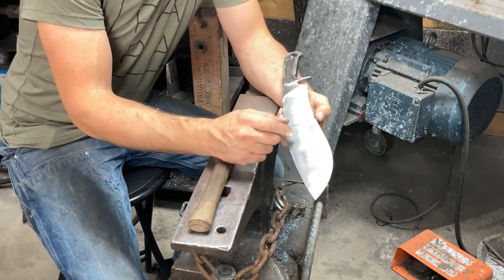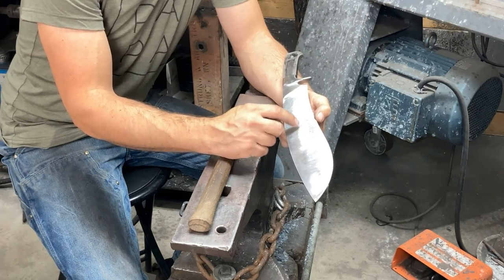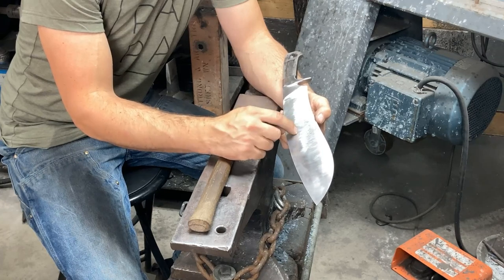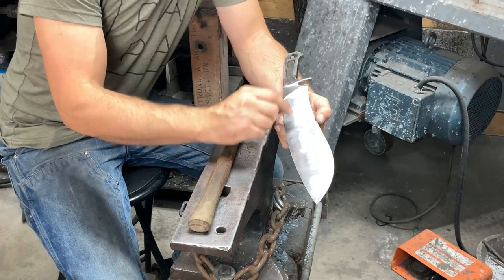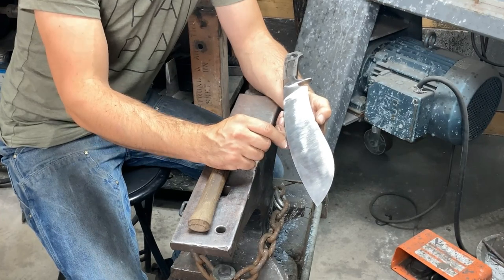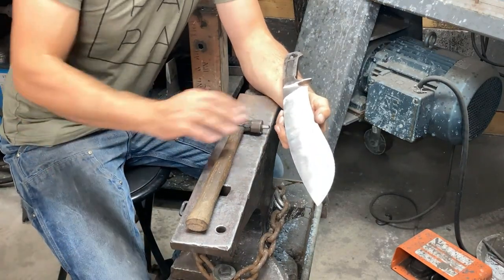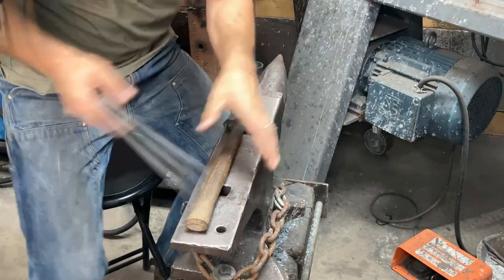If you notice something farther down the line and you're at a 400 grit hand sand, why then all you got to do is do this and then drop back momentarily in the affected area to like a 400 equivalent Gator belt, the A45 or whatever, and then these will wipe right off too, and then you can just go back to finishing your knife and etch it pretty quick. So anyway, I thought I'd show that because it's pretty helpful for subtly finish correcting things after they're hardened.